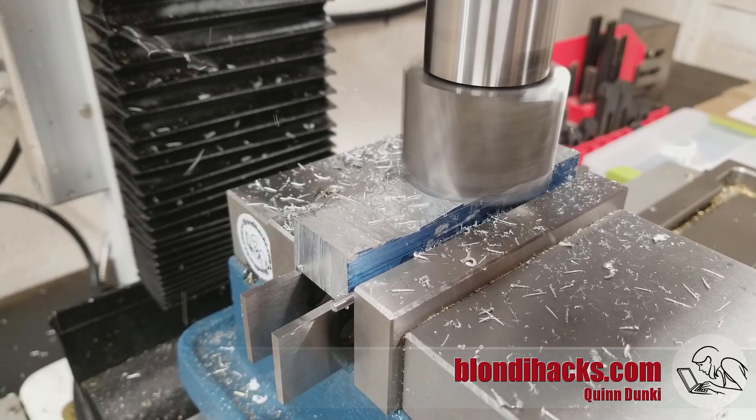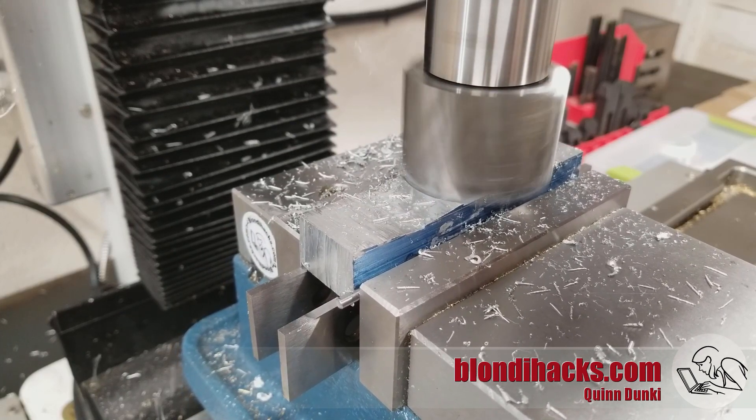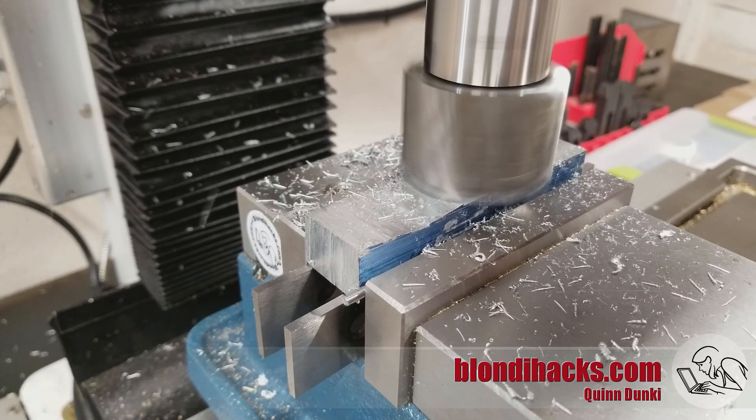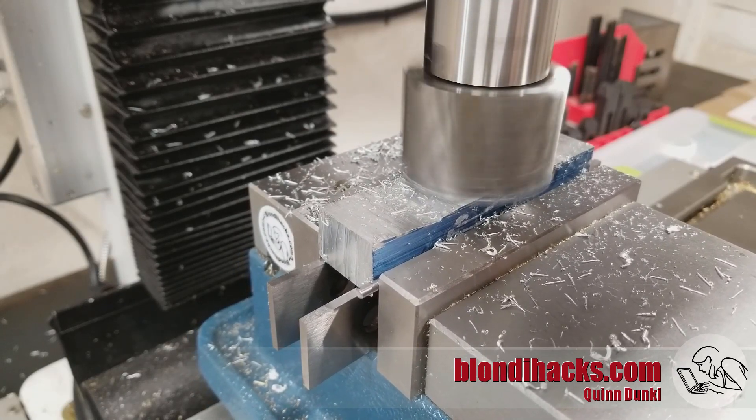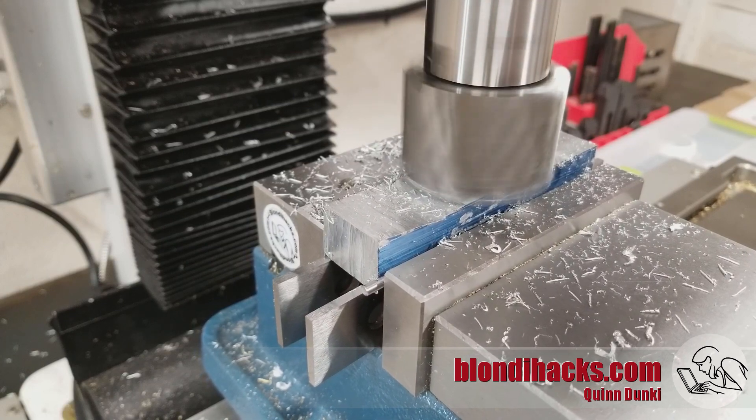This is a two-and-a-half inch cobalt shell mill. The sides are not going to be machined and so they're not perfectly square, so in order to hold them square in the vise you use something round — like a ball bearing or in this case a piece of drill rod.